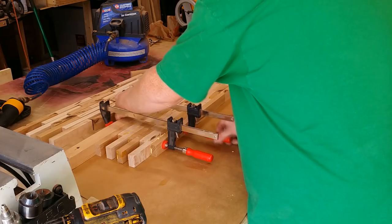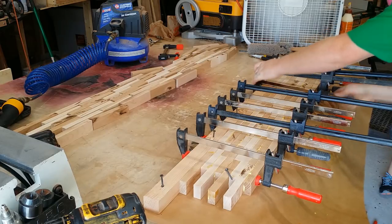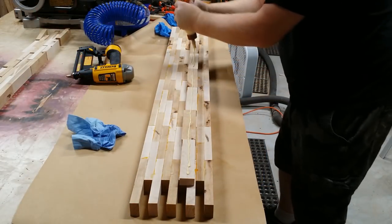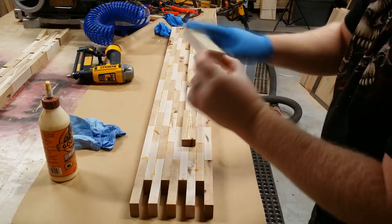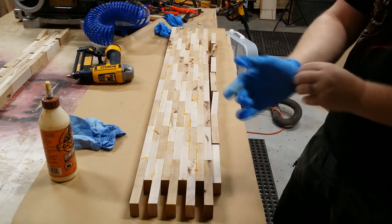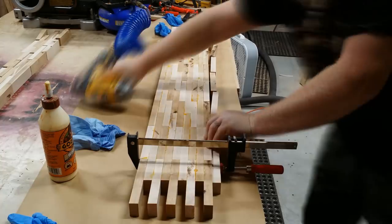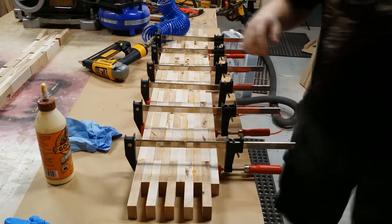So I'm actually going to show you a second strategy that I think worked very well. If I were to do this project again I would probably try and deal with it more in this strategy. Here I'm just trying to do one run at a time, using fewer brads, and getting to clamping really quickly — so this is so much better of a strategy. As I get to the end of the run I could start back at the beginning and remove two clamps and start adding the pieces right away. And this worked out very well.